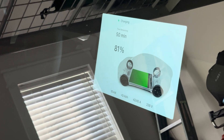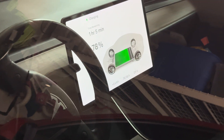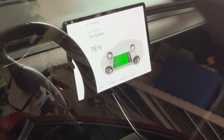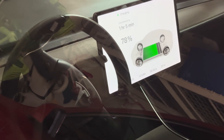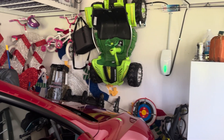I'm not sure why one goes to 42 and one to 38, but as long as they are never going over a combined 80 amps — which is 80% of that 100 amp breaker that the sub panel has access to — we are good to go. And I'm going to change these back to charge to 80% instead of 90, which I set just for this video. So I hope that helps. That is power sharing on the Gen 3 wall connectors.